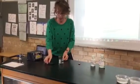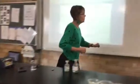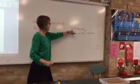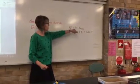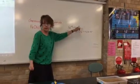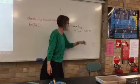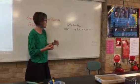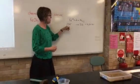Now, chemically, what are we doing? Well, we've connected our artefact to the negative terminal, so we are forcing the rusted iron to reverse the process, to pick its electrons up again and become proper iron, hence conserving our artefact. It's not going to be restored because it's not going to look perfect. We call it conserved.